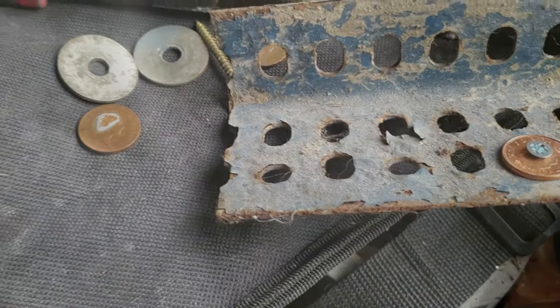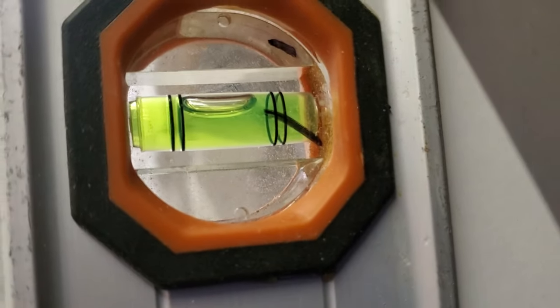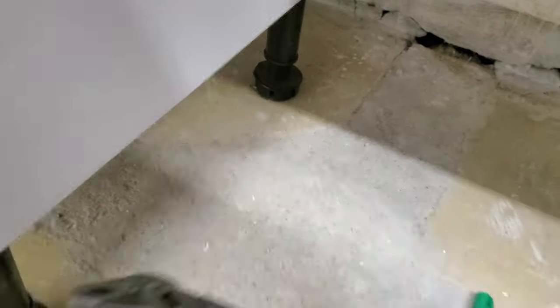If I put my screw on now - look at that, there's a washer! This is what I want the washer for - to go through this metal here and cover the holes. That's a wee tip of the day. I need four of these, that's going to cost me four pence. By the time I would go down to the screwfix I'd probably use two pounds of fuel and sit in a traffic jam. People throw pennies in the street - they won't even pick them up anymore. So the bracket's on the wall. I have to put my wee copper washers on, but before I do that I'll check it's level - and as you can see it's not, so the bottom needs kicked in a bit to make that bracket tighter.